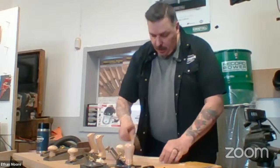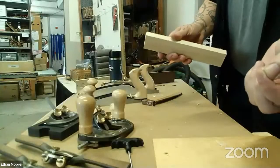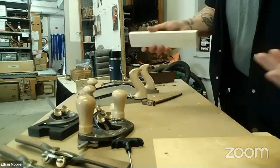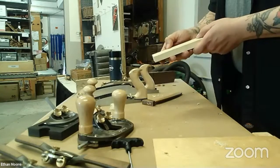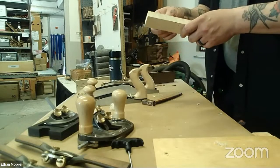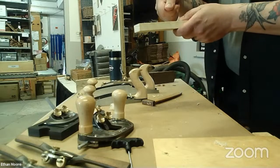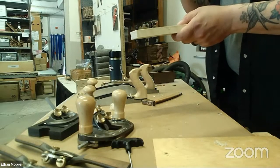So the block plane is very useful — it lives in that pouch. As stuff comes out of the machines, I just quickly take the hard corners off, and as I'm handling it, I'm not having to worry about it. When you take the hard corners off, you get less likelihood of splintering. If something hits the board by accident and raises off a big splinter, then you've got to do the iron trick: take a wet cloth, put it on the dent, put the hot iron on it, and it swells up. But don't grab mom's iron.